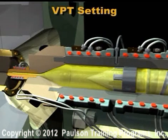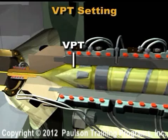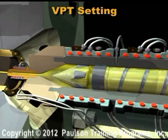At the point where the mold is nearly full, the screw will reach the VPT setting. As I mentioned earlier, this control point tells the machine to change from the fill rate control to injection pressure control. This transfer must take place before the mold is full — otherwise, the screw will try to continue to fill even though the plastic has nowhere to go.